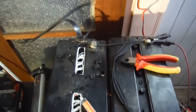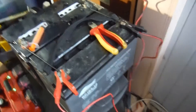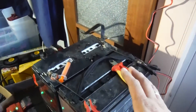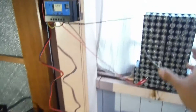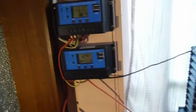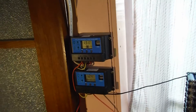We've got about 200 amp-hours here when they were new, so probably a bit over 150 nowadays. We're not going to be in perfect condition, let's say 150 amp-hours. About 12 volts there, we've got another 55 there. It's going to take a little while for the solar panel to charge them at any rate. It's only a 40 watt solar panel.